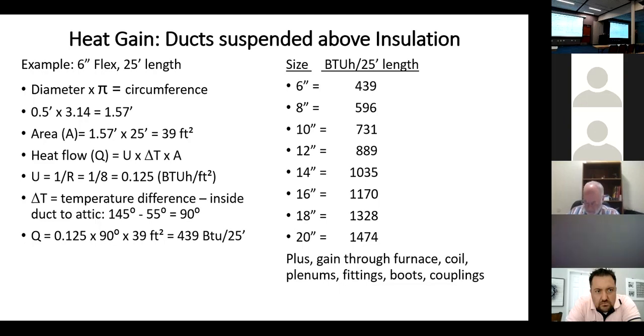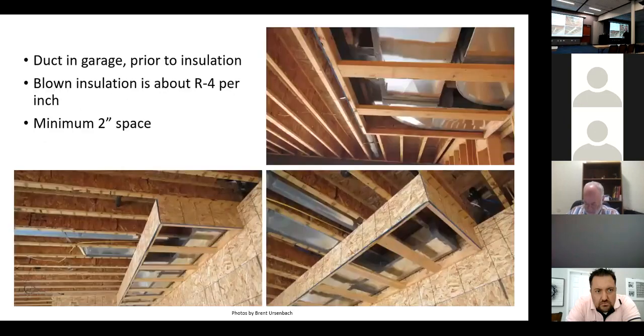And so the only way we're ever going to get it right, and we talked about this earlier, sometimes enforcement has to be a piece of the solution. So I think I have a little bit in here on it. Can that insulation be collapsed at all? Nope. Manufacturer says 0. Okay, perfect. So really, part of the R value: you start compressing insulation, you lose R value. You lose cross-sectional area when you compress a round pipe. The 18 code says you can't deform a dryer vent because when you start squashing a 4-inch, you don't get the airflow. So yeah, you can't squash it.